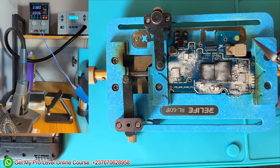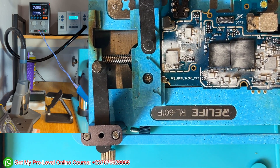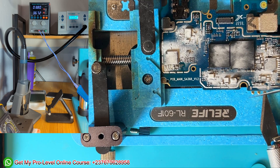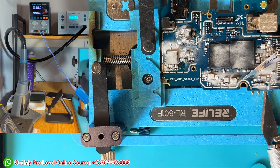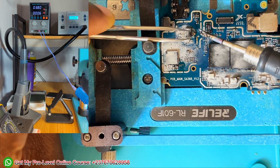I'm going to zoom in so you can see what's happening in that section. When connecting the DC power supply to the mobile PCB you can check the current draw — that's very abnormal, that's a short. I'm preparing my probes, connecting VBAT to GND. You can see that smoke right there — that component is the main shorted component. It being the main shorted component doesn't mean that removing it will fix everything, but we have to try removing it and see how things go.